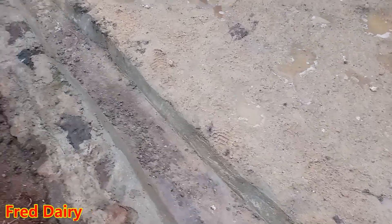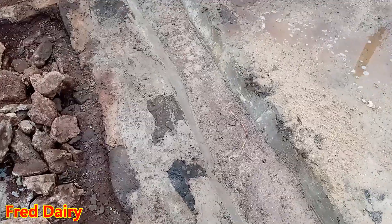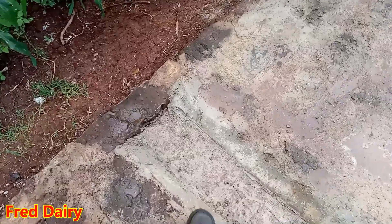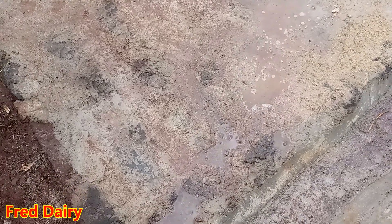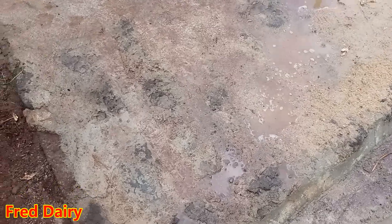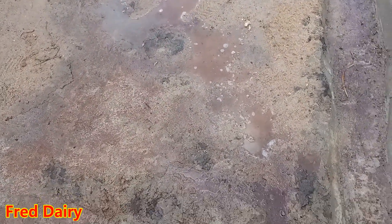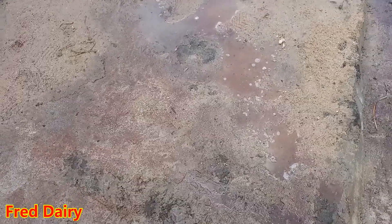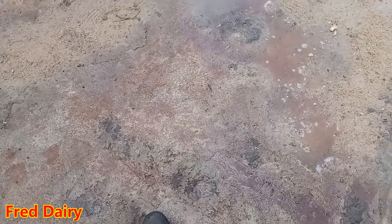So why am I doing this? Remember, curing strengthens the floor and the concrete — everything in the cement strengthens as well. So this is why I'm doing this. I'm curing it for the next 28 days, but right now I'm in the second week, so I'll continue doing this until the 28 days so that I can ensure that the floor has strength.